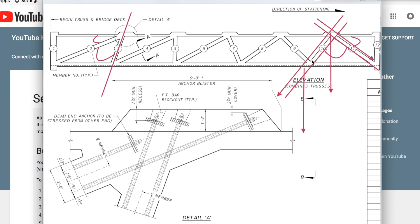This 389 kips seems pretty weird — it's counter-forces to tie the two together at the bottom so they act like a plate, acting as part of the nodes, all four of them. Member 9 has no post-tension members inside it, so it went into compression. They somehow make up for it with four longer post-tension bars that not only put tension but pull it back up, countering the force. Then down to 11 — I'm looking at it like a zigzag load-bearing capacity trick.